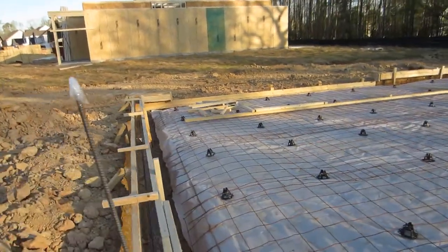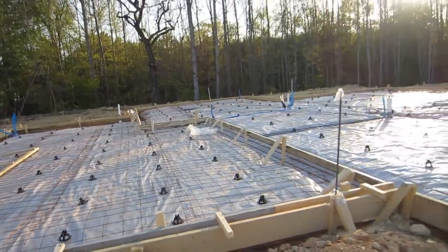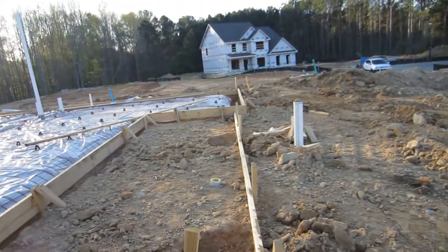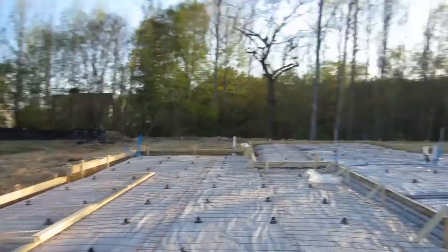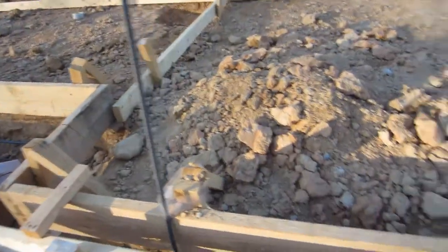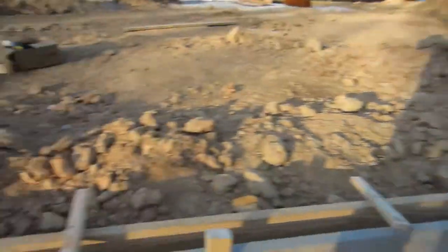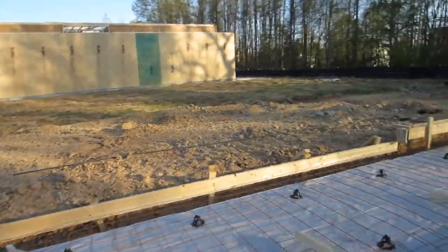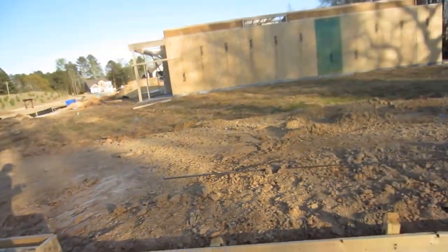I'm going to try to get you around here. That is the garage layout there, and that is the front porch area — there'll be an elevated porch there. And this is the grounding rod — that metal piece of rebar sticking up. That's your ground rod. It should run at least 20 feet in the horizontal, and it will be attached to your grounding system.